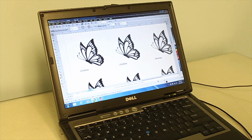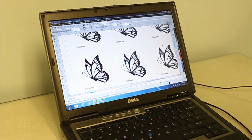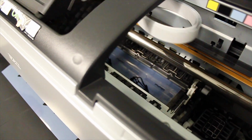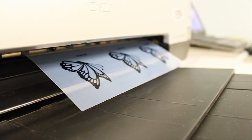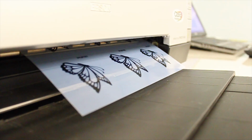The first step for any photoresist is creating your artwork. Most vector programs will work for creating the artwork, but some common programs used in the sand carving industry are CorelDRAW, Adobe Photoshop, and Adobe Illustrator. With washout mask material, you will be using positives for your artwork. The artwork is one of the most important parts of the process. The higher the quality or density, the easier the rest of the process.